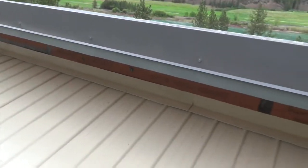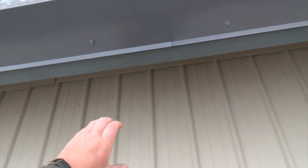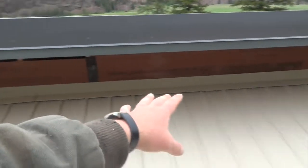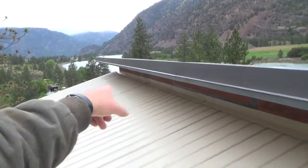I have to put up soffit, and you can't have the edges of your soffit sticking down because they'll swell and look like crap. So this has to stick down — it's an imaginary seven-inch wide board; it doesn't actually come up into here, and then this wraps over and covers all of it. Shay and I got whatever that corner bit is called. You can see the edges are up because apparently you're supposed to split those, cut it back, and slip them together — kind of telescoping. I didn't do that. Not a person in the world but you and me can see this, so get your licks in. Look at that one — god, that guy's an idiot. But no one will ever know — it's up here, and it won't leak.